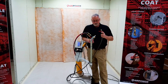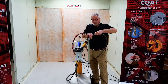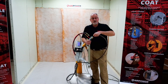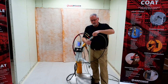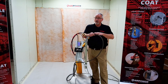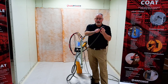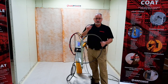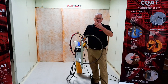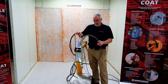Push that back in. The spring you see here just keeps the hose from kinking. It clicks in. We push this back up so we don't kink the powder hose — that way we maintain laminar powder flow, don't put back pressure against the pump, and avoid powder surging as it comes to your parts. That way you get even coverage, with the powder coming out nice and smooth and even.